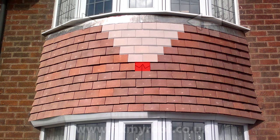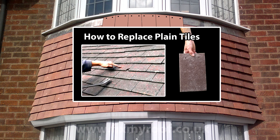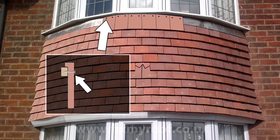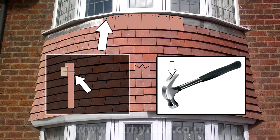The first place to start is by folding any flashings up and out of the way in the affected area. Here I've removed them with Photoshop to make things a little clearer. This gives us a nice clear view of the top course of tiles and the nail fixings. I would recommend that you check out my related video on how to replace plain tiles, which can be found in the links at the end of the video and in the description bar. Starting with the very first nail on the very first tile, the best tactic is to wiggle your way underneath the nail head and between the surface of the tile. Often the best tool is the tip of a flat pry bar.